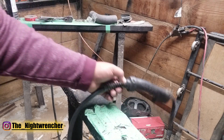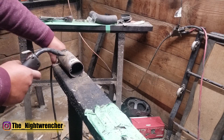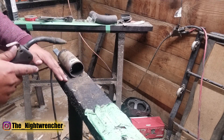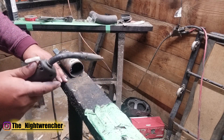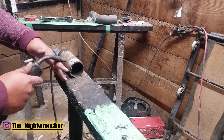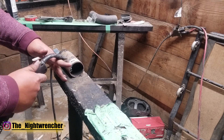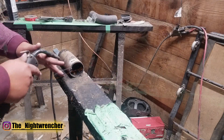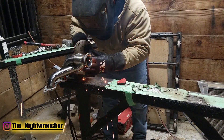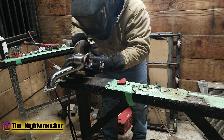Number two is how you guys hold your gun. Some people like to hold their gun like this, some people like to hold their part like this and use their other hand like this. But the method that I like to use when I'm welding is more similar to like if I was playing pool — I actually like to put my hand on the work surface, put the gun on my hand, and then I can apply all the force and weight of the gun and maneuver it however I want to. Especially if I'm trying to weld all the way across, I can maintain my distance with my hands and then slide the whole thing across so I can go through and weld a consistent bead.